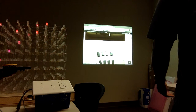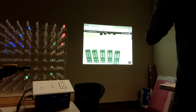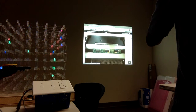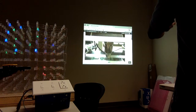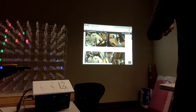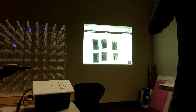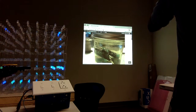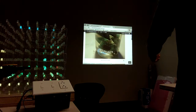So I went the hardcore way. I got all the chips, and then I got these smart boards, and I breadboarded the thing. Well, this is me with my hot air workstation. So I started to solder everything in place, heating up the chips. That's how they look with all the flux. Then you have to clean them up and put them in alcohol. So I got this jar, I put alcohol in it, shook it, so I cleaned it up a bit.